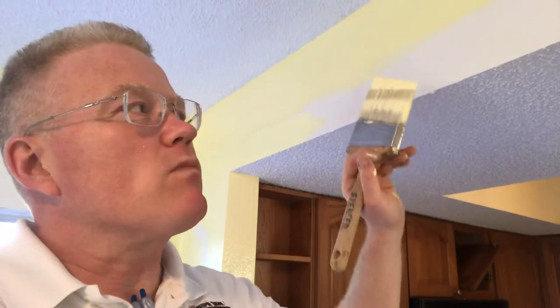So I want to show you how to do it. It's very simple — your brush does all the work. Now, there's actually another way to do this. You know those foam rollers that are now available in paint stores? They're actually foam, and they come in black or white. If you have a bumpy surface and you're trying to paint a straight line, if you go back and forth with a little paint on the roller, you could accomplish the same thing, but I'm going to show you how to do it quickly with the brush.